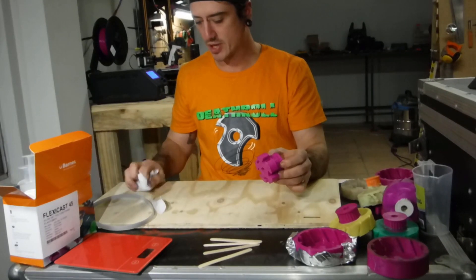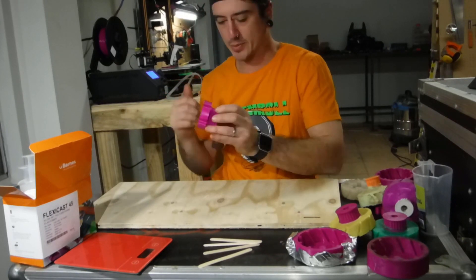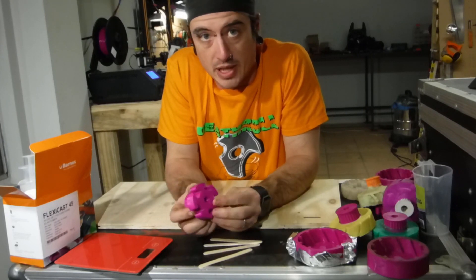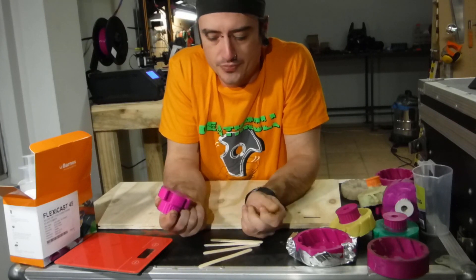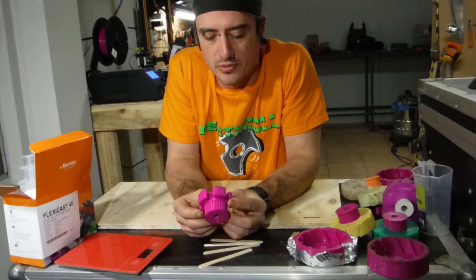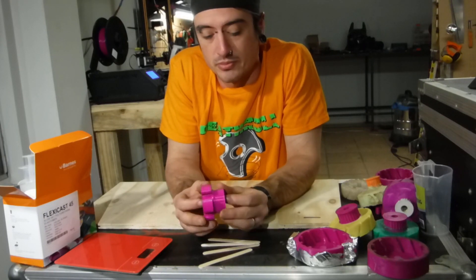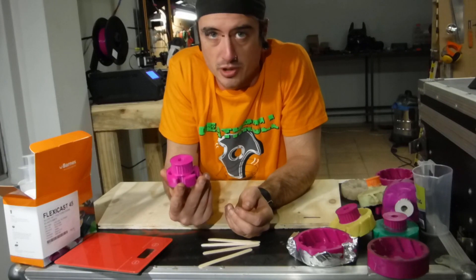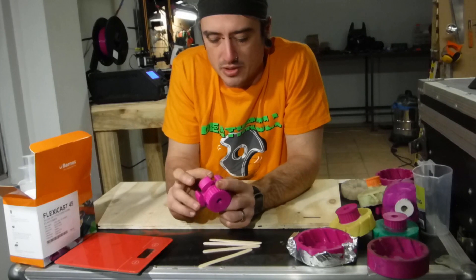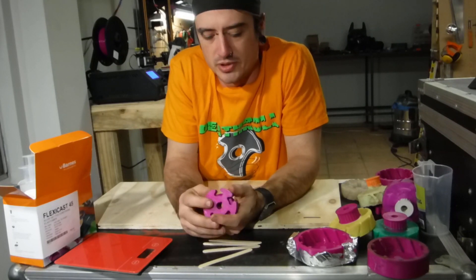The hub for this one is 100% infill PLA — feels pretty strong. It's got a little keyway there for a Banebots P60 16-to-1 reduction. The keyway locks it on and keys it in, putting drive to the wheel. It's also very shiny and glossy because I printed it at quite high resolution.